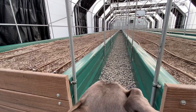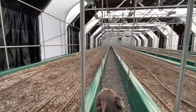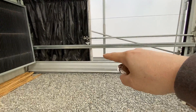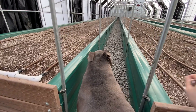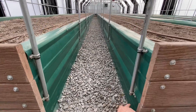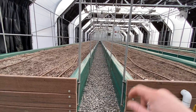The way I built these beds is I have one-inch galvanized posts every six feet. Then I took purlin round tube — as you can see in this gutter — and ran it horizontally down the whole length, fastened with clips to the galvanized vertical posts. Then I took this metal roofing, which has three distinct ribs. One rib sits under the gravel line, and it fits right on those purlins perfectly.